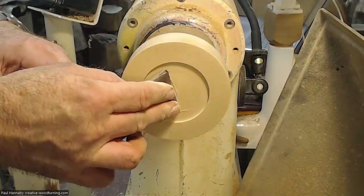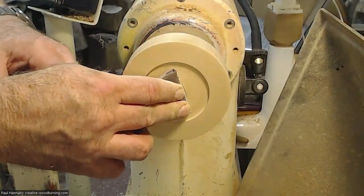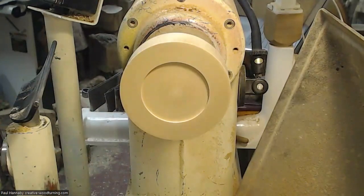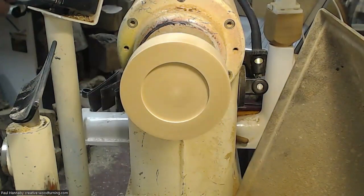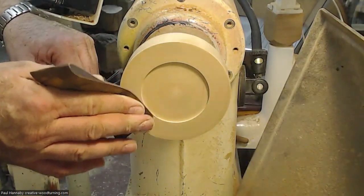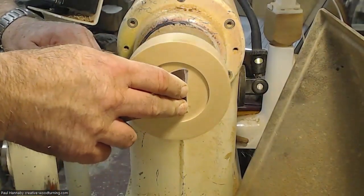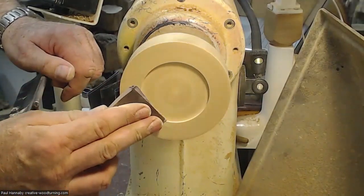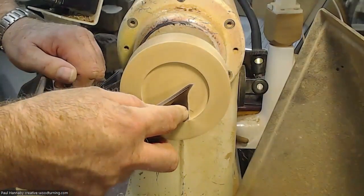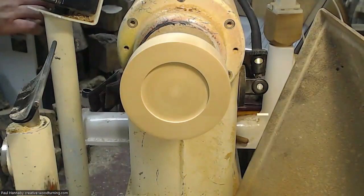Yeah, I've got sand in this all the way down to 16 grit. So nothing's going to get past those. Might not be much wood left at the end of it, but yeah, I bought them with the intention of using them for carving and shaping wood rather than finishing it. Because if you put a 16 grit sanding disc on, it does take quite a bit of wood off. I bought them for my 4.5-inch angle grinder, so they're sort of 4.5-inch diameter discs. So yeah, great if you're doing some shaping and carving.